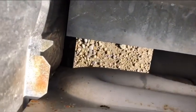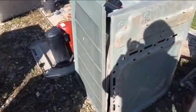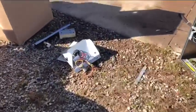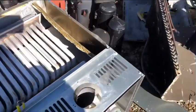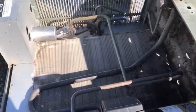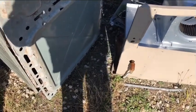Get your water bottles out, get your spray pumps out - you've got to douse the clamshell heat exchangers with water. The other type you've got to physically get in there and look at them. Every time I get to an old furnace I get excited, because there's a possibility it's cracked and I'm going to be able to condemn it. And not only that, I'm going to be helping the customer by keeping people from getting sick, because carbon monoxide at smaller doses builds up in the bloodstream - it's extremely dangerous. It slowly suffocates people because you can't get oxygen in your blood. It's a serious thing - it's not something you want to take lightly. That's our job as professionals: to get in there and ensure that the system is working properly and it's safe.